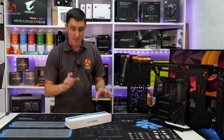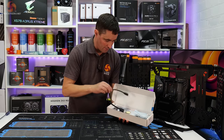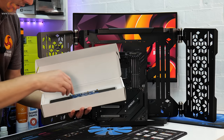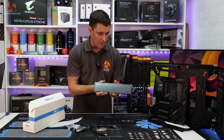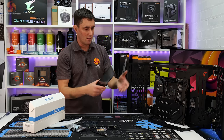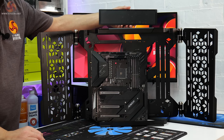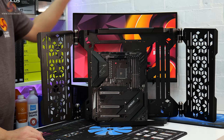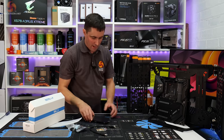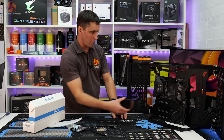But one thing that I'm definitely going to be doing is installing what is inside this box. So have a quick look. Got some HDMI cables, some standoffs, some bits and bobs, and then actually inside the box is this, which is an LCD display. So I'm going to be using this for system monitoring, so temperatures and clock frequencies and stuff like that. Now, I've not decided exactly where I'm going to put this on the frame yet. I was thinking at first maybe have it mounted somewhere here up at the top. The graphics card is going to be vertically mounted on a Gen 4 riser, so that's going to be down here somewhere. So maybe it could go down at the bottom as well. Maybe could use this bottom bracket to hold it in place down at the bottom.